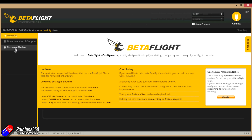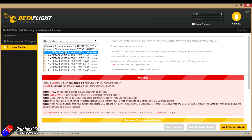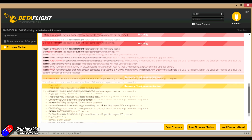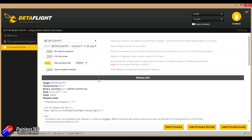So if I disconnect and go into the firmware flasher, we'll make sure it's the Betaflight F3. Version 3.1.7 is the latest as I'm doing this. I'm going to have to use the Zadig drivers to convert the DFU device into something I can talk to. If you're not familiar with what I'm talking about, go and have a look at the USB flashing section of the Betaflight manual. I'm going to update this to 3.1.7 very quickly and then join me back at the bench to continue with the setup.